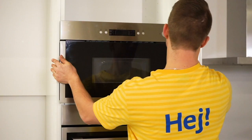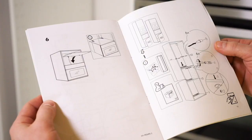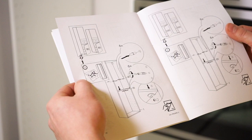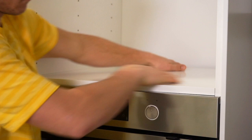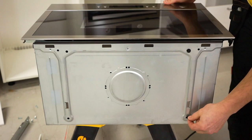It's now time to install the microwave. Read the assembly instructions carefully to calculate where to place the shelves for your microwave, as there can be variations between different models. Add the shelf above the oven. With some microwaves you need to install spacers before placing them on the shelf, in order to get the right distance between the microwave and oven. Place the microwave onto the shelf and use the screws to attach it to the cabinet.